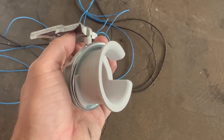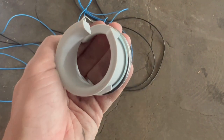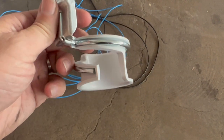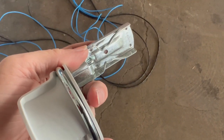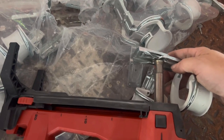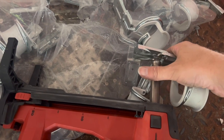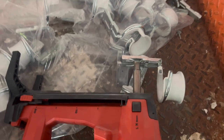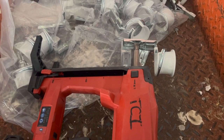The star of the show will be these bridle rings. A bridle ring lets me slip the cables through nicely, and there's a hole right here where I can use to fasten it directly to the concrete ceiling. In order to make that fastening happen, I'm going to use this Hilti cordless concrete nailer. The bridles connect directly to the tip, which you apply to the ceiling, and then you've got yourself a beautiful pathway.